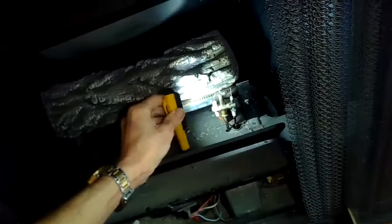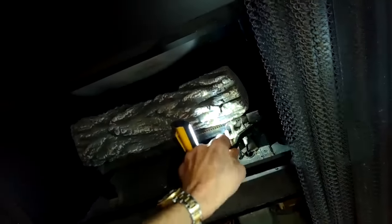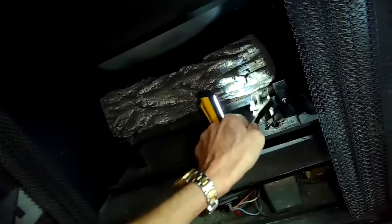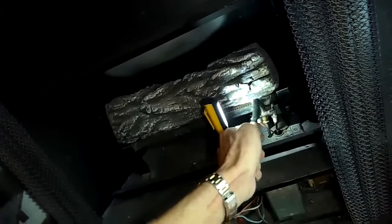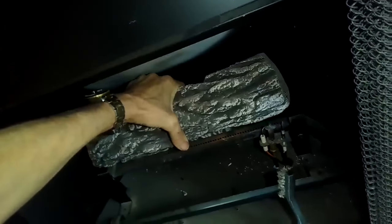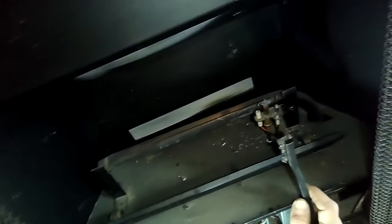Cleaning this little pilot hole will help. We usually just use a wire brush — pretty easy to do. I'm using the wire brush to clean the part called the thermocouple, which is what senses the heat. I'm cleaning the electrode that produces a spark, and I'm cleaning the little hood where the gas comes out, because the spark has to jump over to that, and if it's dirty it won't make a good spark.